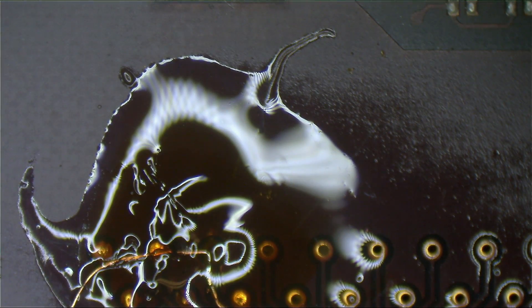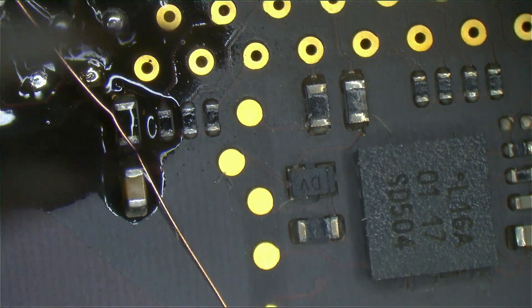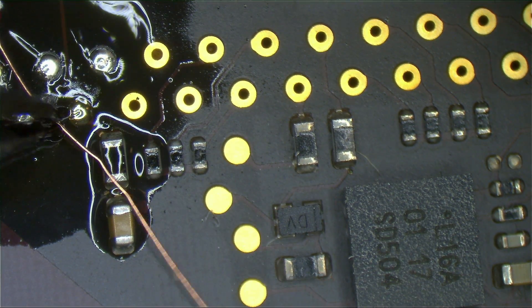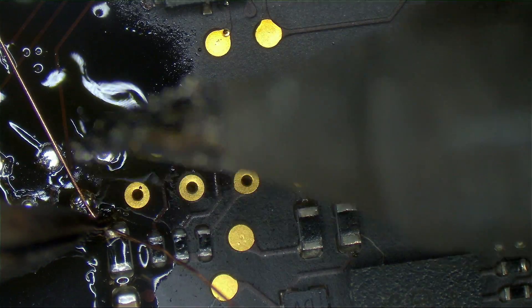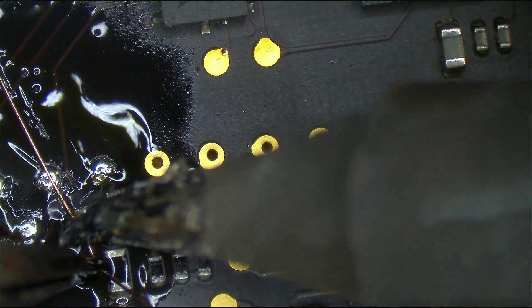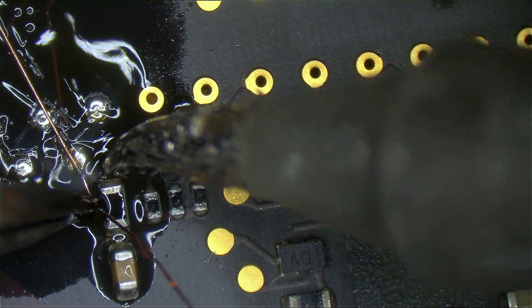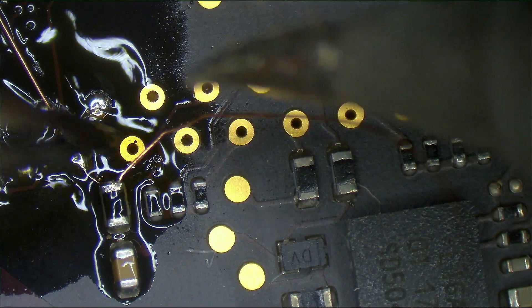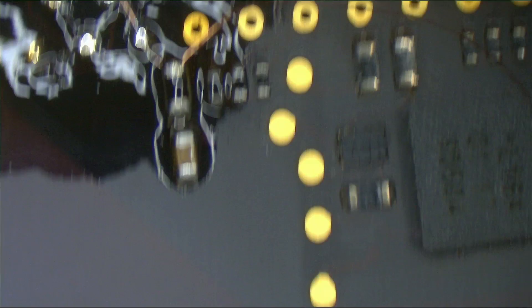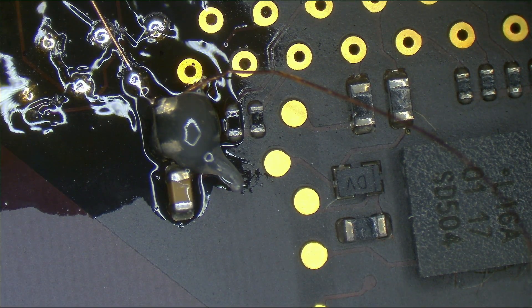Oh, which one? On the top it's the top one, the third — which means when I flip it, it's gonna be the bottom one. The third. Only one way to find out. Yeah, it's good — it's going to the resistor. See, it's got to be this one. This is the one kilo ohm resistor that was in the schematic in between keyboard and SMC on-off L. And just for the hell of it we can also terminate it at the resistor.